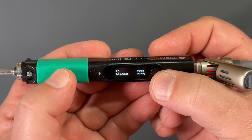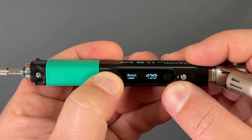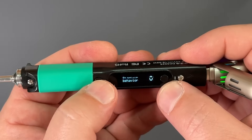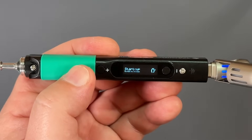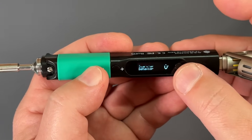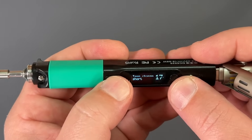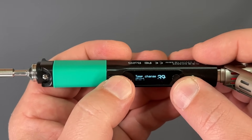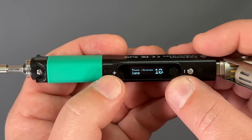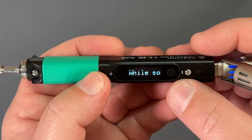The QC voltage you can set, PD timeout, then we can go into soldering settings and here's where we can set the boost. I'm going to set mine to 800 degrees, so when we long press the plus button it'll boost up to 800 degrees. Startup behavior — you can set it to start up at no heating, rest heating, or full heat. You can change the temperature in increments, up to 50 degrees per one press — I'm just going to leave mine at 1. Long temperature changed — a long press will change the temperature by 10 degree increments. You can also allow locking of the buttons.